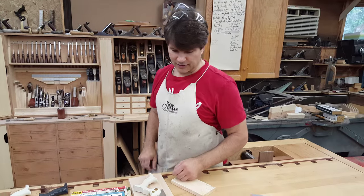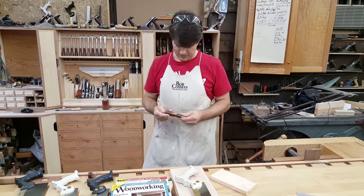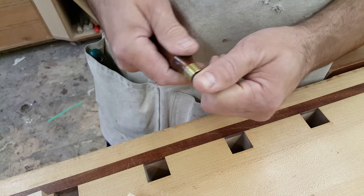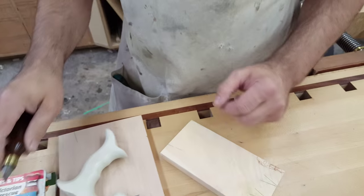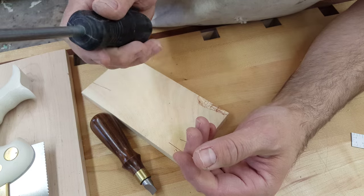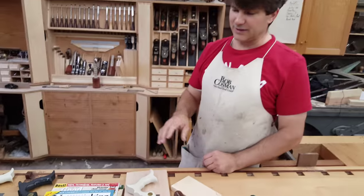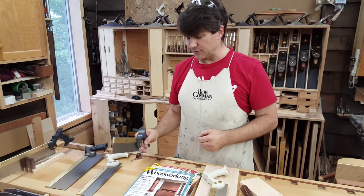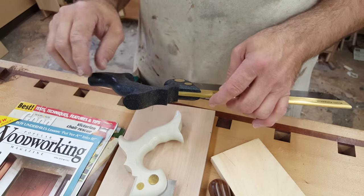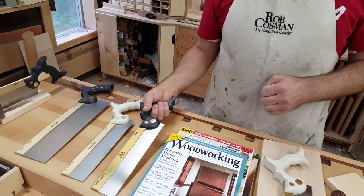Just a little bit about the handle. I appreciate pretty handles and pretty wood — there's a screwdriver made out of cocobolo, and as good as it looks, it's very awkward and difficult to get any torque on. This is my favorite screwdriver: it's got a rubber handle, large diameter, and I can get all kinds of torque on it. I would rather put my dovetails on the mantle to be displayed as opposed to my saw. The handle in the saw is made out of a composite material — it's extremely heavy, about two times what the same size piece of maple would weigh. It helps to balance the saw, and gives you that extra weight so gravity helps in training you how to make a plumb cut.